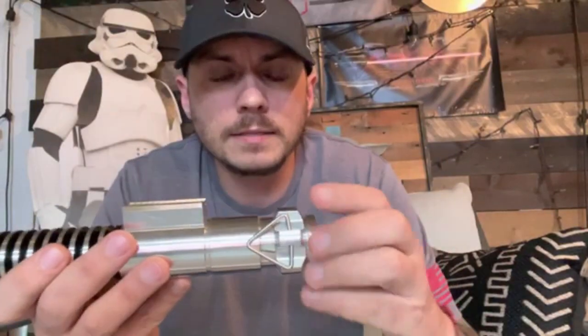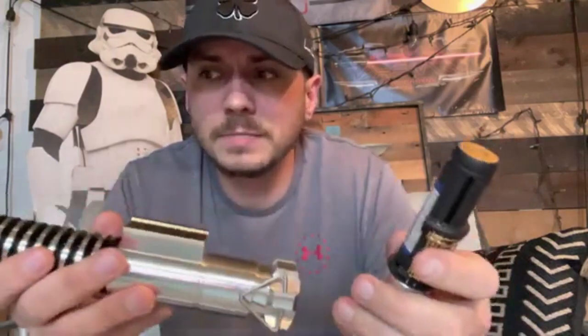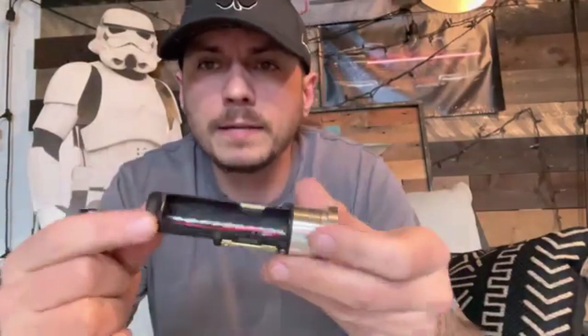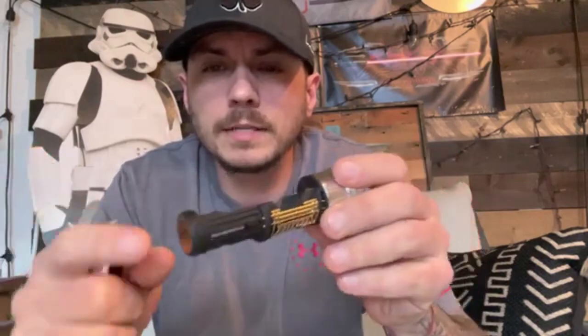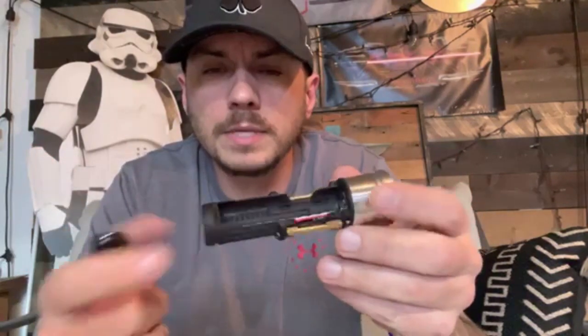Your backside here will unscrew to get to your battery — I left the battery in it. This is a little bit different from the last Master chassis I did because I did put the OLED screen and the kill key in this one. Once you take this out, you've got a removable battery. There's no spring side — your negative is on this side, over by your PCB.